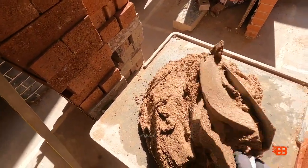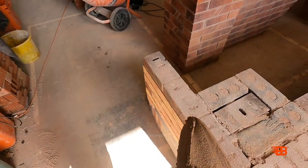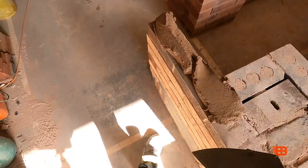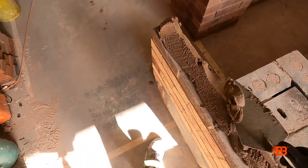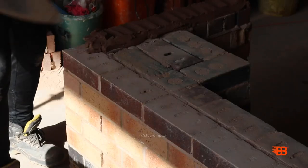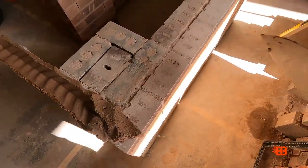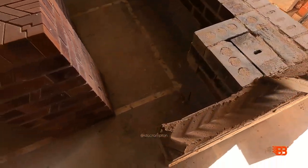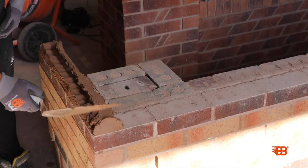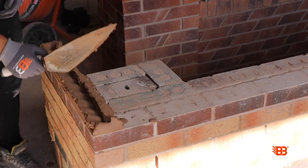Already using those trowel techniques we've used — hopefully you're a bit more practiced now. So I'm going to start over here. Got to the right side using all those trowel techniques. I know I keep repeating myself but just keep ingraining those good habits. Always back to your board for a bit more and any excess back on your board. Just clean up as much as you can, and then with that bottom bit — scrape until you've got a nice uniform bed.